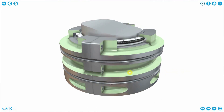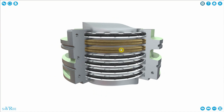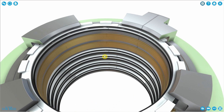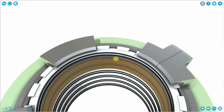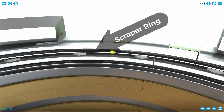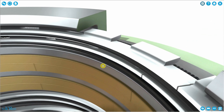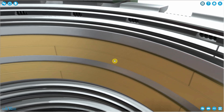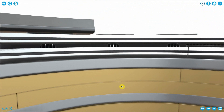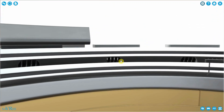Let's now take a look at the stuffing box in more detail. If we take a cross section, we can see inside. We've got a piston rod running through the middle. Working from the top down: at the top we've got some scraper rings — these black items here are called lamellas. They're manufactured from iron and are used to scrape off debris and cylinder oil from the piston rod, preventing it from entering the crankcase. Lower down, we've got some bronze pieces — these are sealing rings, which prevent scavenge air from entering the crankcase.